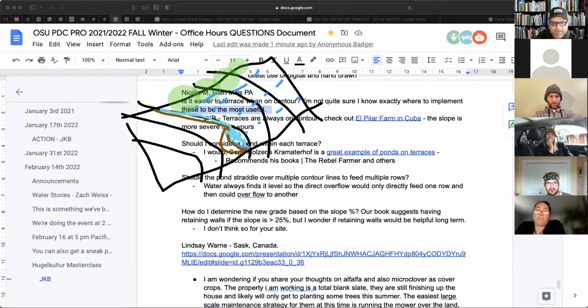so say the pond all fills up, then it'll come back out, and normally we'll do an overflow, and you'll have seen this in the material in the course called a level sill spillway. And we'll put the level sill spillway away from the dam itself, because that's where all the energy has gone into. So we want to keep overflow away from this infrastructure. The sizing for the level sill spillway is the square root in meters of the total area that is the watershed. So that square root ends up becoming the length in meters.